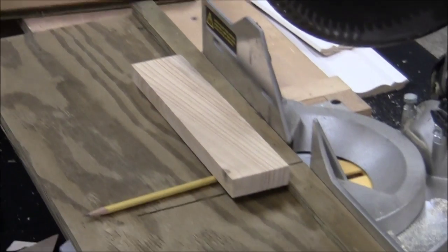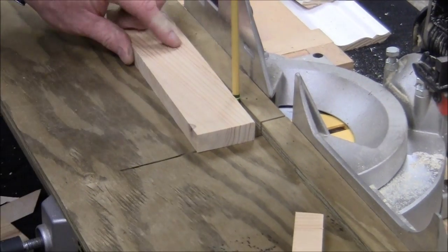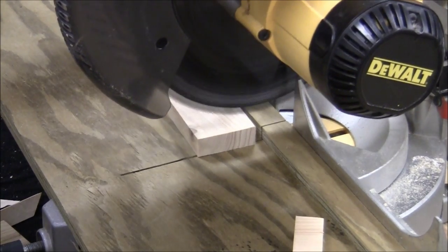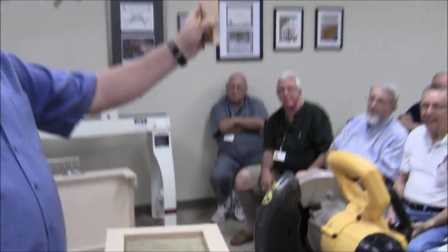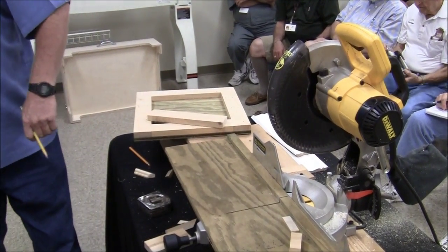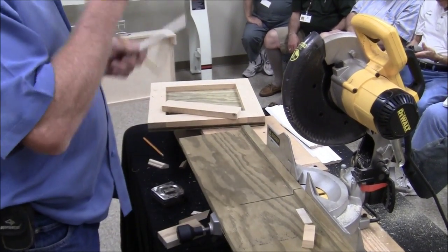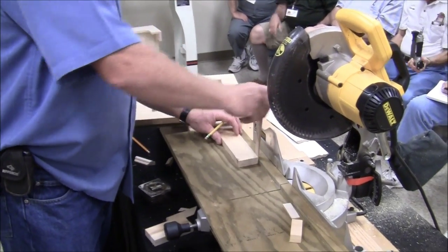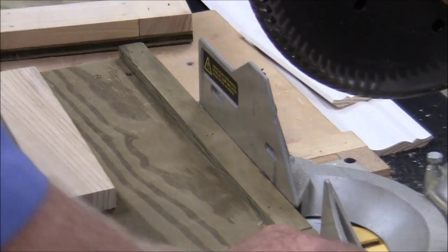That pencil can also be used in the other direction. If I've got to make an adjustment on my cut in the other direction, I can put the pencil behind the piece like that. That's a pretty big adjustment — you can see how it throws me way out of square. But you look around and you've got things you can use to make minor adjustments. Once we set our table up, we didn't like swinging it back and forth because that just chews your table up. So if you've got to make a small adjustment, you can use a little clamp or a shim behind it.